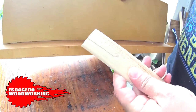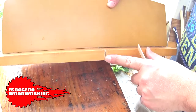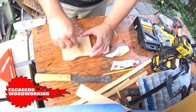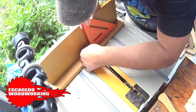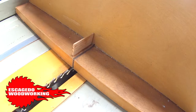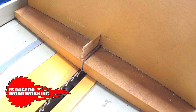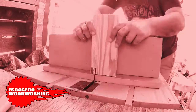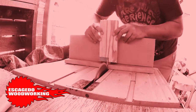I'm testing this strip of wood for snug, and it is — it's the same thickness as the table saw blade. I'm using epoxy to set the strip, which is the key. It should be placed next to the blade, only one kerf space over. Notice we have the kerf of the blade, a space that's the same thickness as the blade, and then the strip. The strip is the key that you'll place each consecutive finger joint on as you make your cuts.